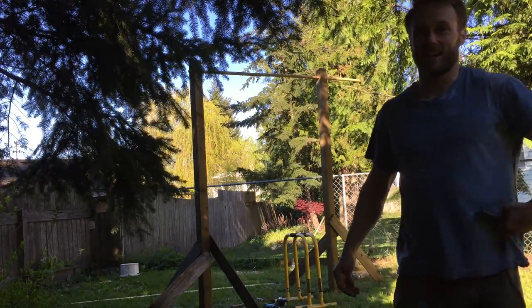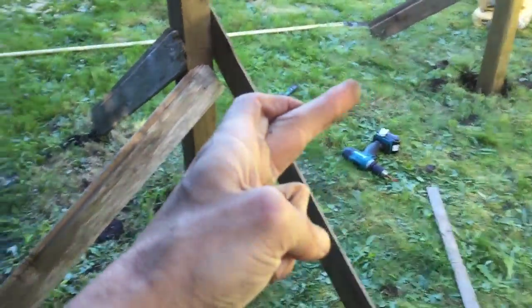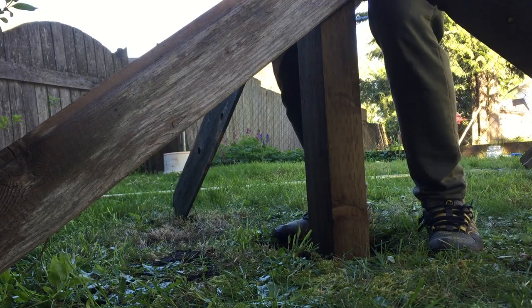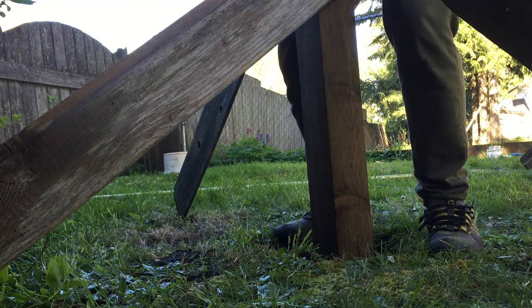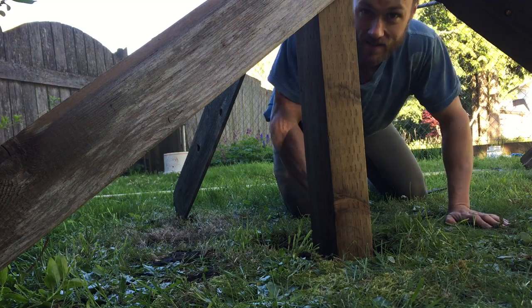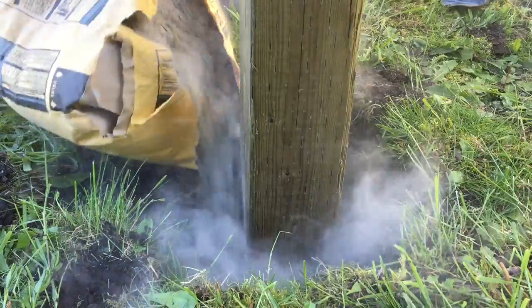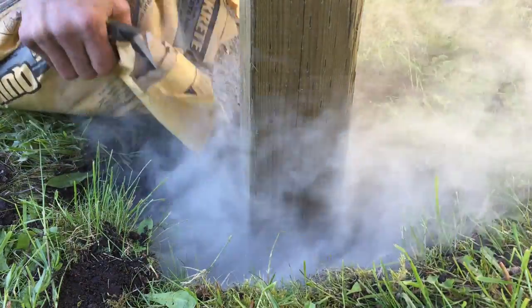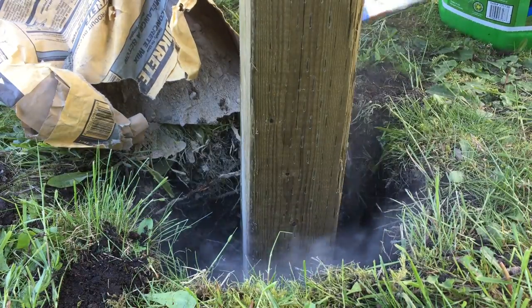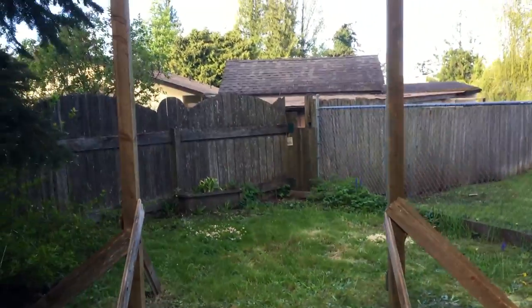Not even close — that sucks. I've got to raise that side up a little bit on the left. I've chocked a bunch of rocks in there and I'm going to lift it up so some go underneath and raise it just a little bit. In hindsight, I definitely should not have been lazy — I should have dug the other one deeper rather than raising this one up, because it's definitely a little shakier. Hopefully that's the right amount. Now that everything is level and I've checked it twice, it's time to mix the cement — I'm just using the hole to mix it, adding a little dry then a little wet. I've done this for many fences before and never had any problems.